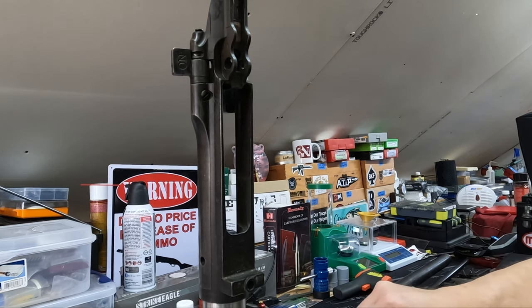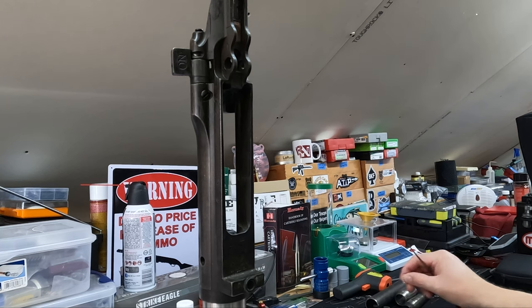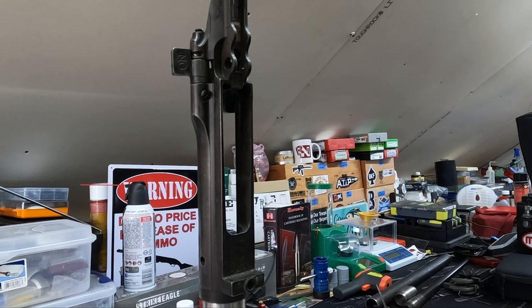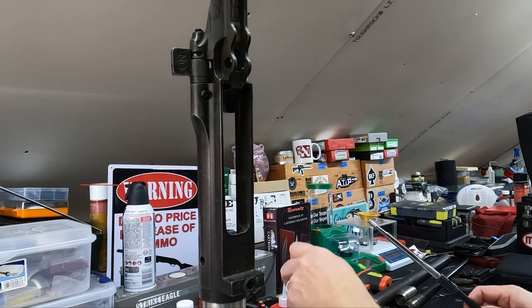Now the key thing is, like I said, you gotta keep cleaning these chips out every so often. I don't have compressed air up in this part of the shop. I do down in other areas of the shop, but we'll just flush it good. So I put a bucket below it to flush our reamer. And then, of course, we'll continually wipe it down.